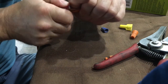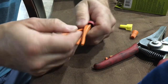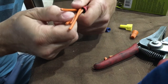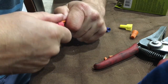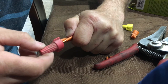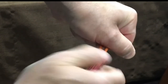You'll need a variety of wire nuts depending on how many wires or what size wire you're joining. Too small and you can't get all the wire ends started; too big and you won't be able to tighten it down, possibly causing a bad connection. When tightening by hand, the wire nut should stop — you should not be able to keep spinning it. If you can continuously spin it, you have too big a wire nut and need the next size smaller. On very big wire I've used pliers to tighten them down for a good positive connection. Here's an example of a wire nut that's too big because it won't stop spinning by hand.